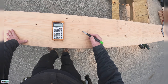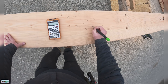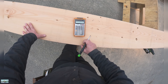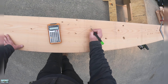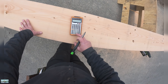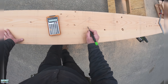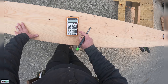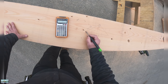The span of our roof triangle is 37 foot 11 and a half inches. I want center, and I also have to subtract the ridge, which is 5 and a half inches. So 37 foot 11 and a half minus 5.5 inches, then divide by two — 18 foot 9 is my run. That is from the edge of my ridge.